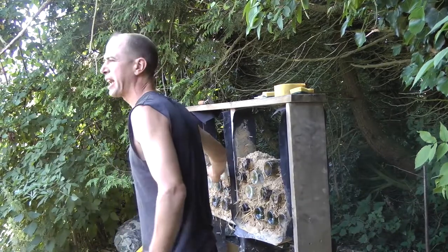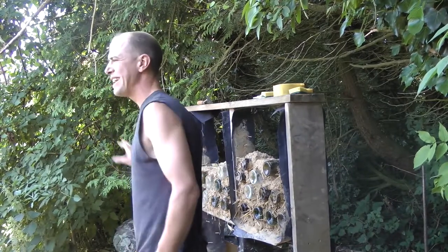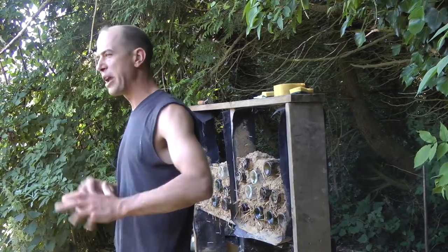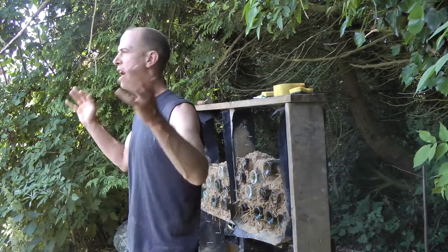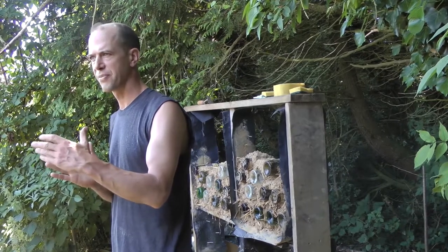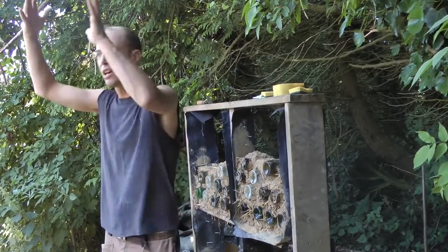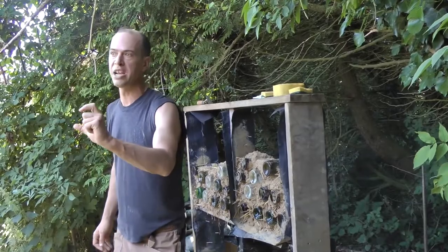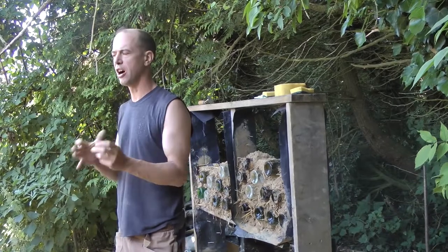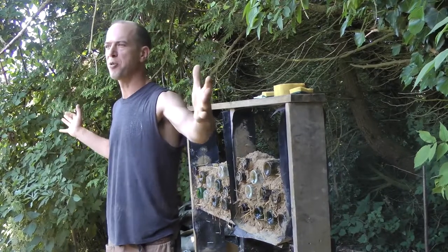So we need to have a really thick mortar join, which is this joining of the bottles together, and that's got to be at least 1 inch, 25 millimeters, 1 to 2 inches. Now, the bigger your wall is, or the higher it goes, I would suggest that you need to expand that mortar join appropriately. So if you're going really high in a single pane, you would maybe do a 3-inch mortar join or more, depending how high you're going. You see? So it's an equation of the needed strength for the size of the aperture you're filling.